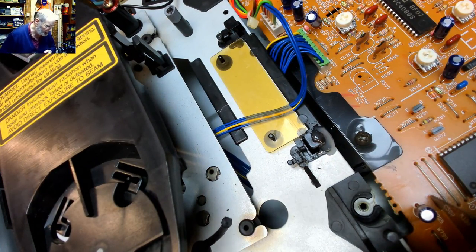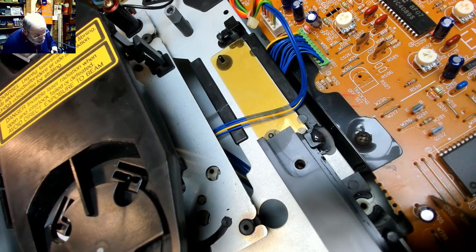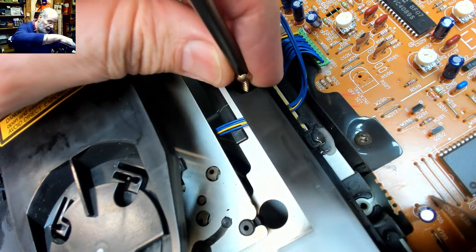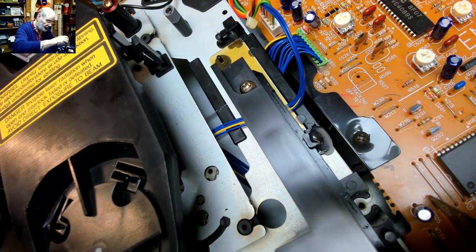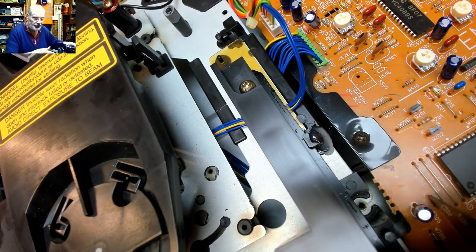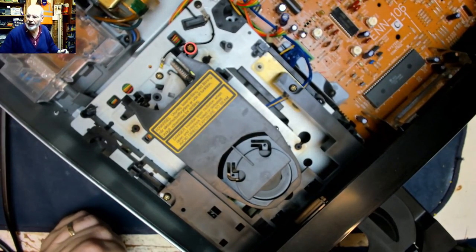And so if we pop the tray back into it now, very gently, it's in that little slot there, we push it through the gears, and so it just runs into there, and that's now in the right place. So now we can put that there and put the two screws back into the tray that act as stops. Crude but effective. Does the job. Basically stops the tray from shooting out. Bit like Arkwright's till, as it was doing. And hopefully with that switch that we managed to fix over this side as well, hopefully that will allow us to have a good working mechanism once again.